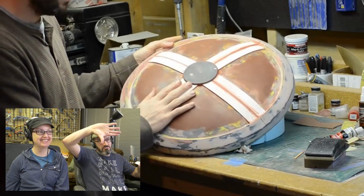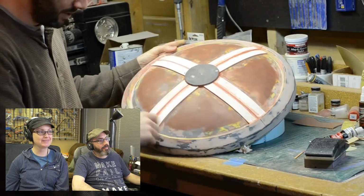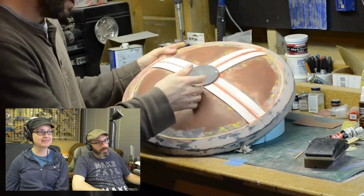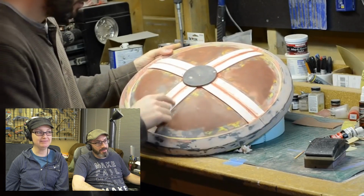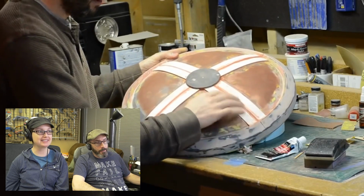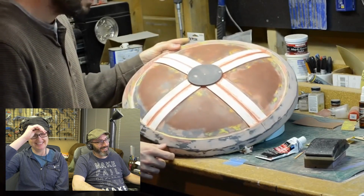Glued down to the face of the dome, and right now what I'm doing is filling in all the edges and seams that were created. First with Bondo for some of the bigger things, and now I'm going in with this glazing and spot putty to fill in more of the surfaces. Lots of smoothing out and sanding. This is pretty close to done.